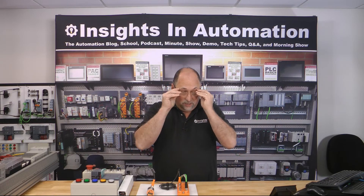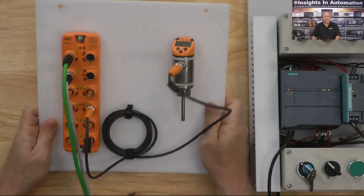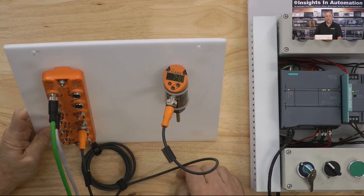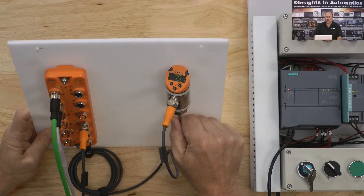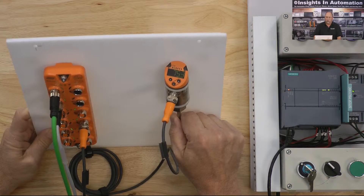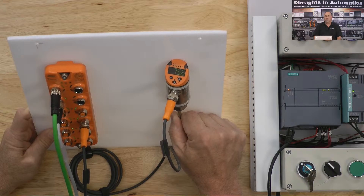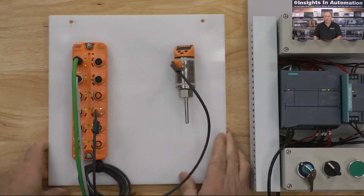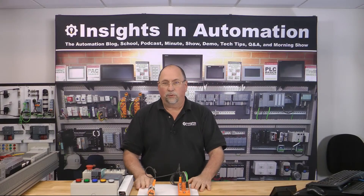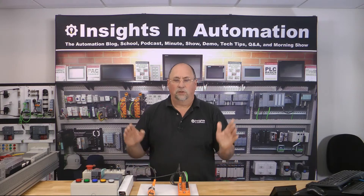Let's take a look at the device we're going to be setting up today. You can see it here — this is the temperature sensor. It's getting a little hot in here with all the studio lights on. When I tested this out yesterday morning, even though I have the unit set to display Fahrenheit, what I was seeing in the PLC was Celsius — 77 Fahrenheit was giving me 25 Celsius. This is a hands-on demo that if you come to my training courses here at the Automation School within an hour of Albany, New York, you'll be able to actually try it yourself.